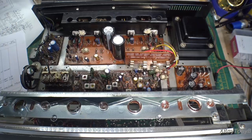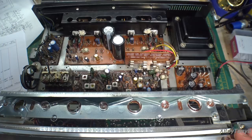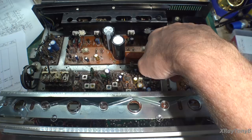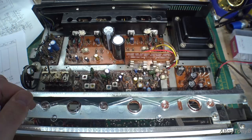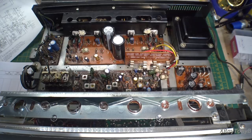I'm back — it's been a few days, working in between other projects. So far: we got the inside and outside of the receiver cleaned up a little bit. We replaced all of the capacitors — good, high-quality ones. This transistor right here was dead shorted and this resistor here was cooked. I went ahead and replaced the current limiting resistors and put a new set of MJE3055 transistors, which is a 90-watt replacement transistor. They'll never wear out.